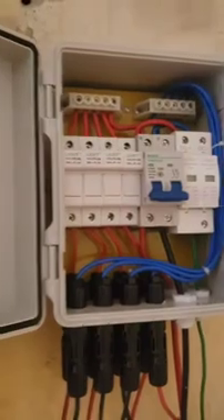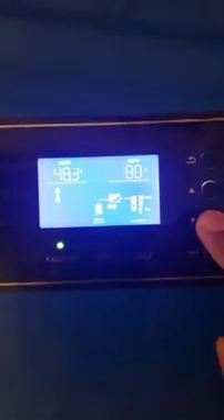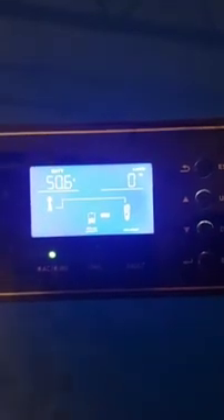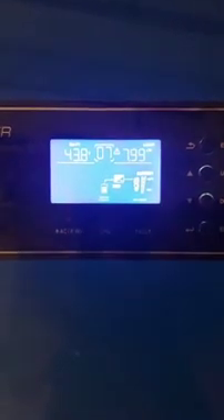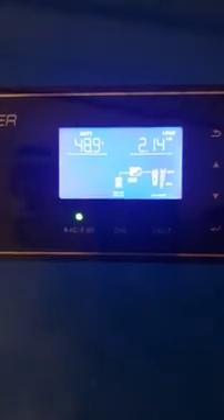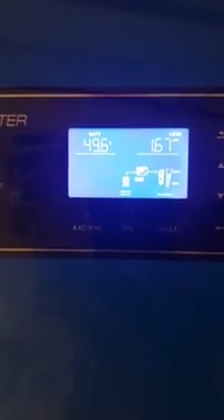Notice that the charging light is still blinking even though the PV array is off. I'm gonna turn on the generator, bypass the inverter, wait 10 seconds, and then turn off the generator. System fault 07 — and now the system recovers. It was able to hold 9.6 kilowatts on the batteries.